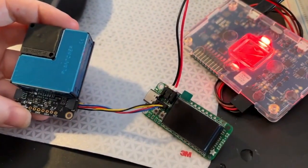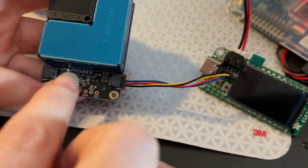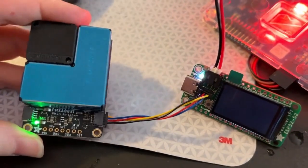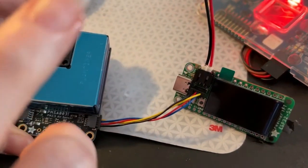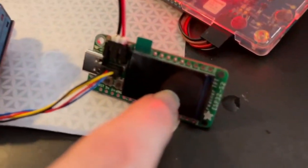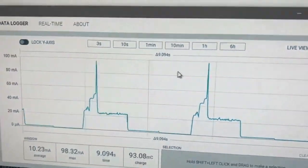I'm just about to release the ESP32-S2 TFT Feather. I actually ordered PCBs and then realized that I was not de-powering the I2C pull-ups to peripherals, which meant they were getting back-powered, which changed the low power draw. So now I'm really testing the heck out of it. I've got this big chunky PM2.5 sensor connected to I2C, and I'm also testing turning the backlight on every second.